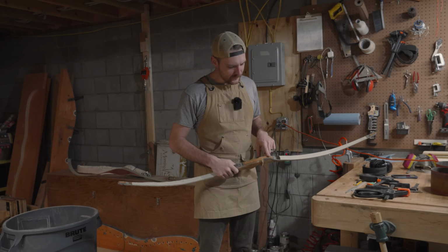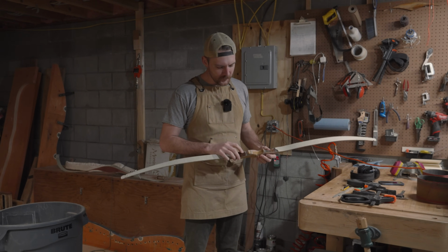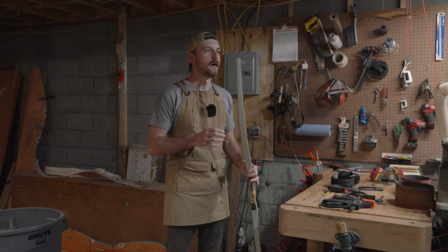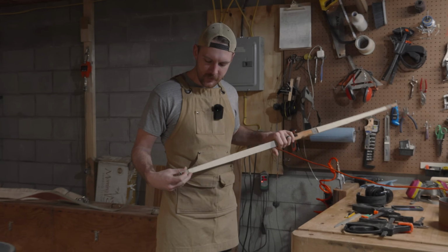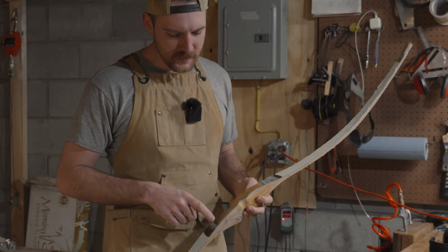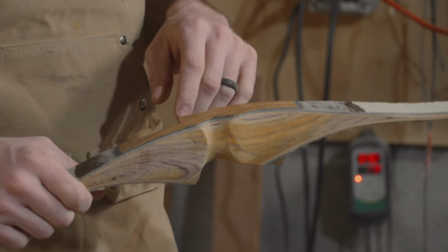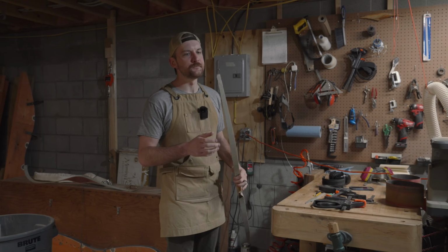I just ground out the overlays that we glued on yesterday. My new little grip overlay, which is going to be pretty standard on all my bows now. The tips themselves, yesterday we glued on 2 pieces of 1/16 phenolic and topped it with cocobolo. The grip overlay, instead of using glass right there, I used black diamond wood, which looks the same as black glass. It's just a little cleaner to grind. And then a piece of cocobolo there.